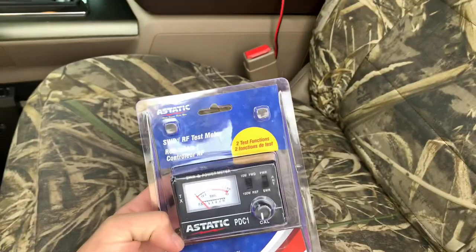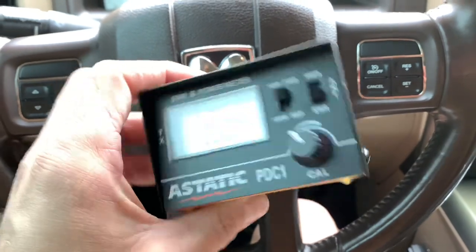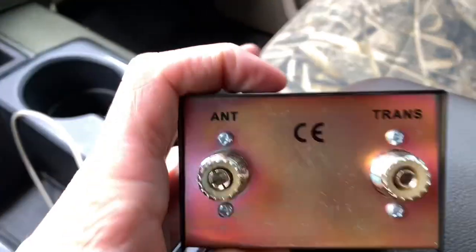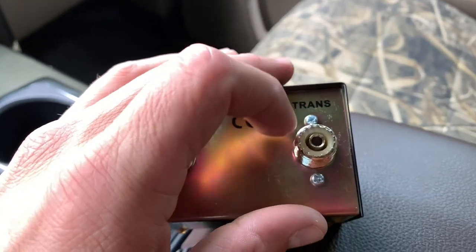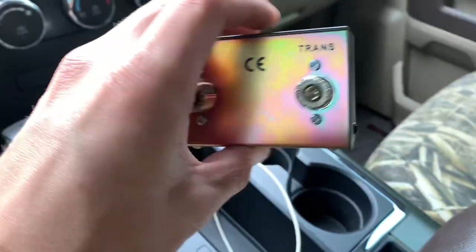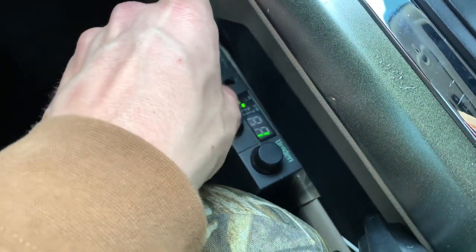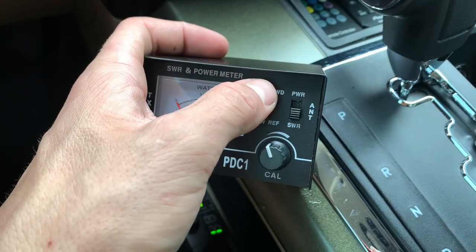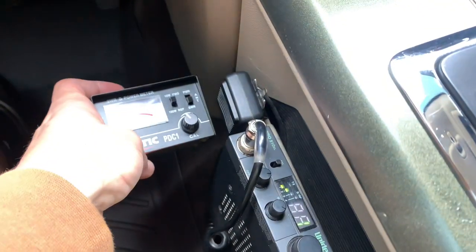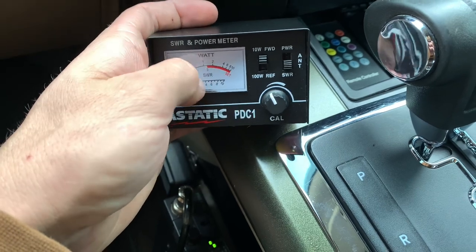This is what I'm using to test it — also from Right Channel Radios. From my understanding on how you tune an antenna: your coax cable goes to the antenna right here, and you're gonna get a jumper cable that goes from your CB — the transmitter — and plug it in here. Turn your CB on, cut the squelch down just a little bit, go to channel one, then turn your squelch back to where it just stops. Put it on FWD, get the microphone in close proximity, key up the microphone, then use this little knob to adjust the needle — you want the needle to be at 10.